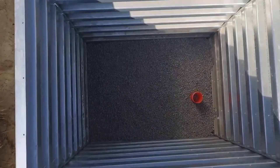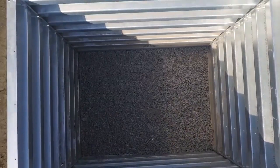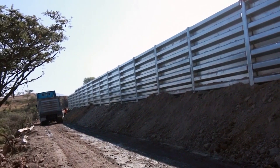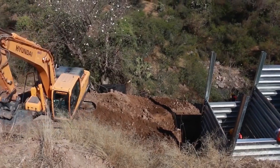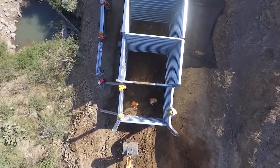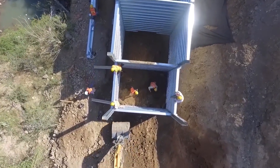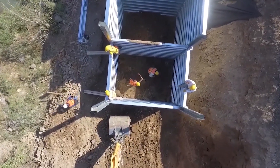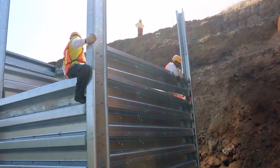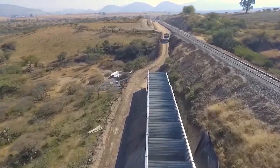You don't need expensive tools or specialized equipment to set it up. Bin wall is used for many things, such as reinforcing roads and railroads and preventing erosion along the coast. The system can also be used as a breakwater and can give military installations an extra layer of protection. It can also be altered — the bin wall can handle sudden changes in the ground that would break more rigid structures.